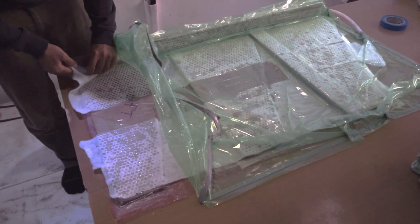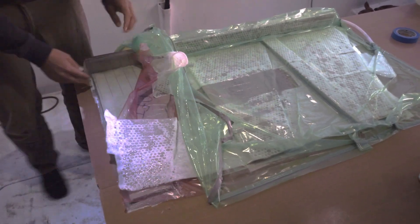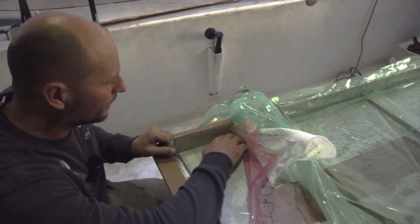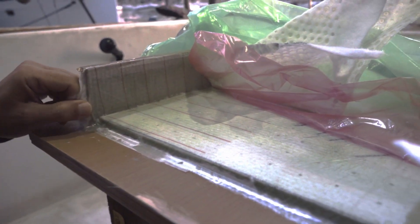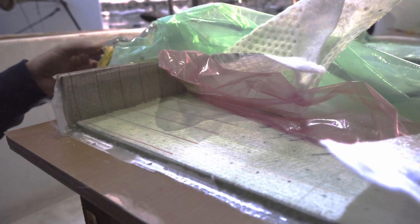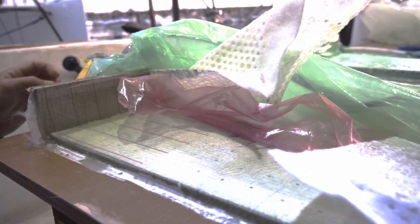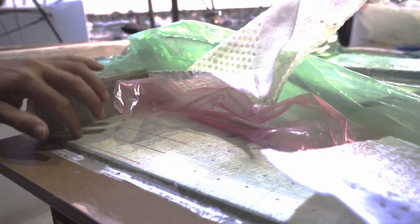Let's have a quick little look here. So I've made a return flange on these bulkheads with this little upstand. And we can see - yeah, I sort of boiled it. I need to get myself a vacuum gauge so that I can stop boiling it. Because I actually make bags that seal. It's normally the other way - you're always struggling to get your bag to seal and you don't get it to seal well enough, and you don't boil it. But I've made a decent table and I'm making decent bags and getting good vacuums, so I'm boiling the polyester resin a little bit.